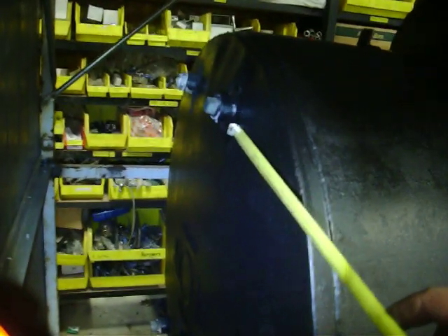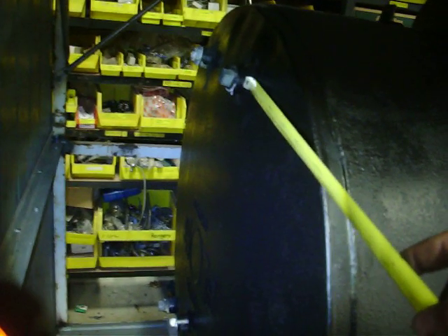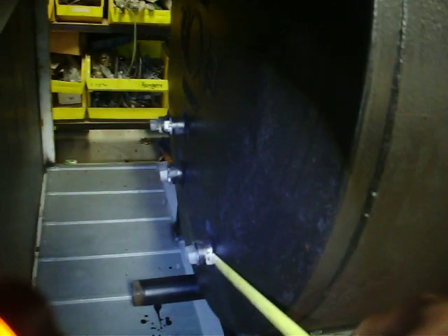On the back side here I've welded in some one-inch threaded couplers — these will be supplies or returns. I'm probably going to run my supply off one of these bottom ones, and I have one more in the front which will probably be my return, to help the water circulate. I didn't put any baffles inside. Down at the bottom there's a two-inch pipe where I'll probably put just a one-inch ball valve in case I need to drain it.